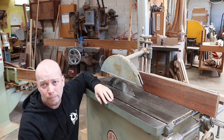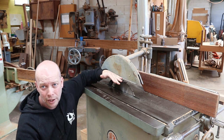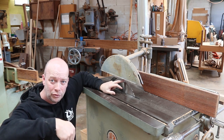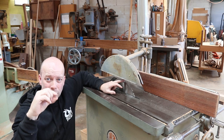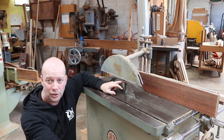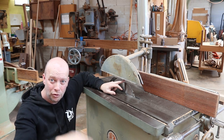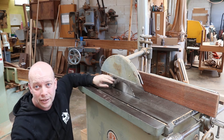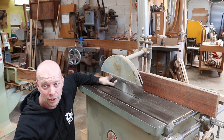When you're setting these things up, you want to have your guard down as low as possible but still able to use the saw without the guard impeding anything. You want to have your saw blade up as high as possible when working with timber, because you want your saw to cut down through and have as little of the blade passing through the timber as possible. If your blade is set too low, your blade has to push through the length of the grain on the timber and it's got to work a lot harder. So bring your blade up and let it cut down and through, not along. Have your guard down in place, have your riving knife in place, and you've gone a long way to reducing a whole stack of potential accidents.